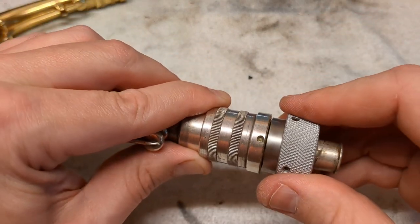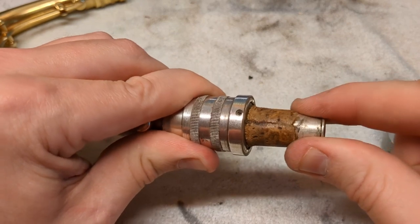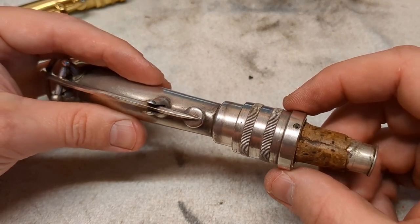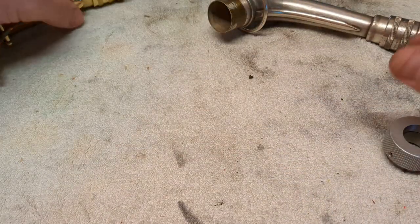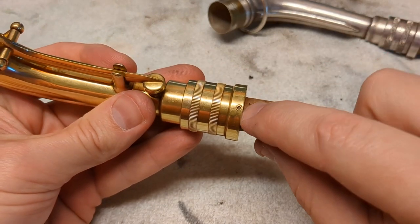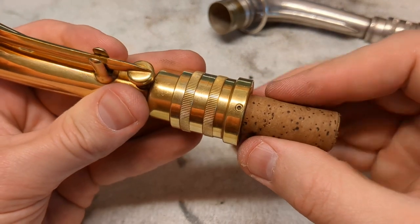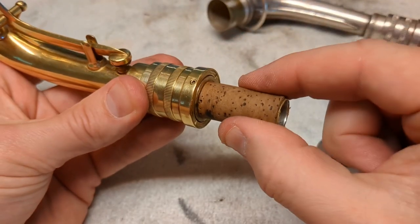We can sort of see the difference again. Let's see if I can screw this in so we can see. There's the hole where it's lined up, and there's the motion. Now, a lot of times on these old retaining rings, you'll see a second screw hole. I've never heard it directly from anybody, but I always assumed that was somebody just taking up play eventually. If we were to screw this in to where it's as tight as it can be while still allowing motion, we could just draw a little mark right here — about a quarter turn from where the original hole is. And that would tighten things up considerably.